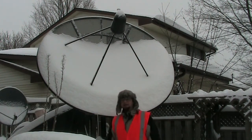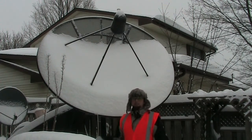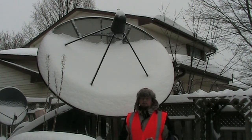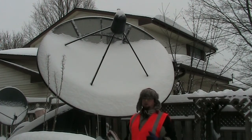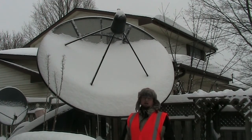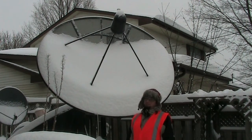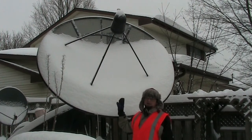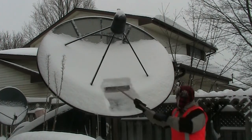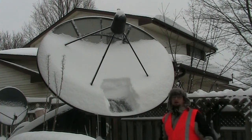We've got about 15 centimeters of snow. In the wintertime I usually keep the dish parked on 99 West for those channels. I can still get the Lassie mux — it's down about 20 SNR — but the other transponders such as the KRBK mux and the Caribbean mux aren't coming in this morning. There's still some C-band signal getting through, but it is blocking the DVB-S2 stuff.